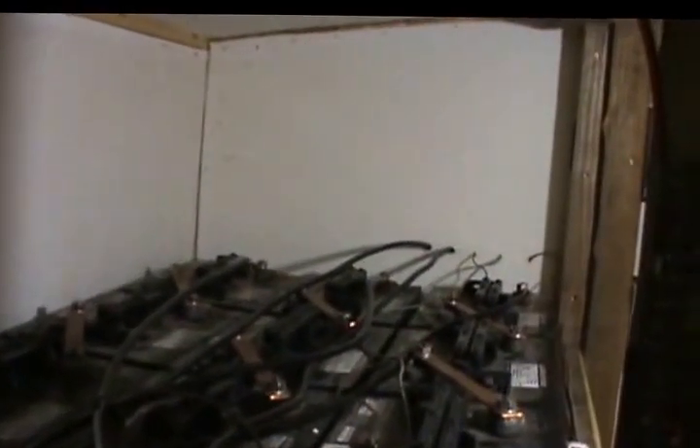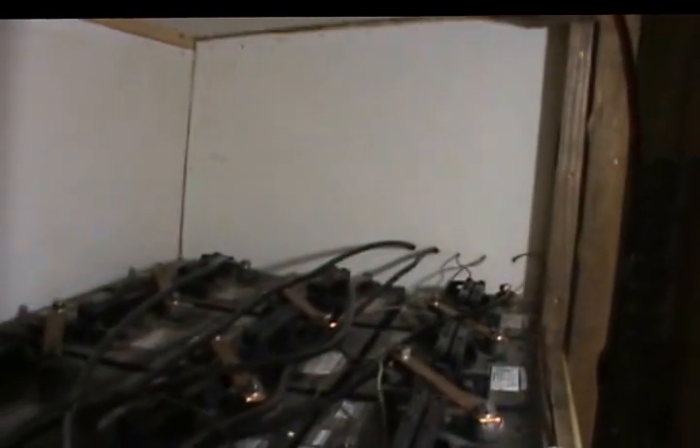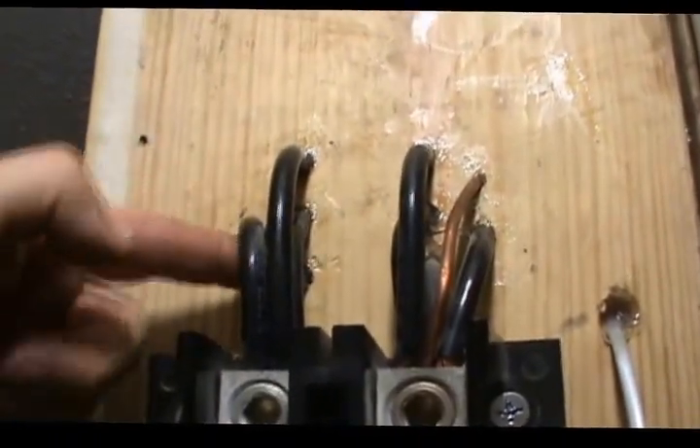You can see that one set of wires coming through the wall over there — that's from the charge controller — and it's paralleled with these groups of three equal-length wires from each end. I've got eight batteries in series here, with three groups of eight in parallel. Then the three strings of batteries and the charge controller all come together.